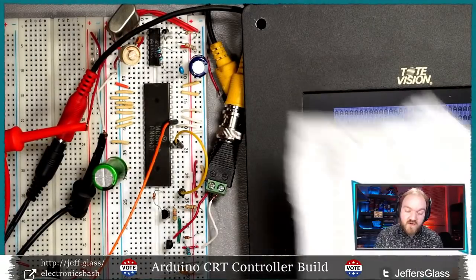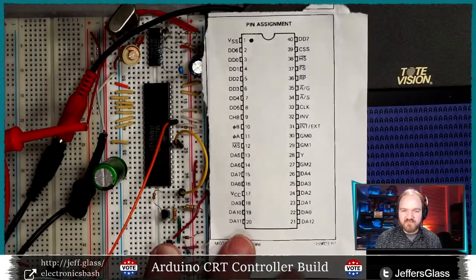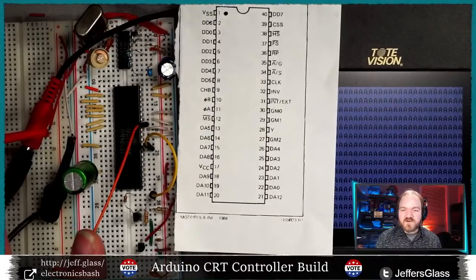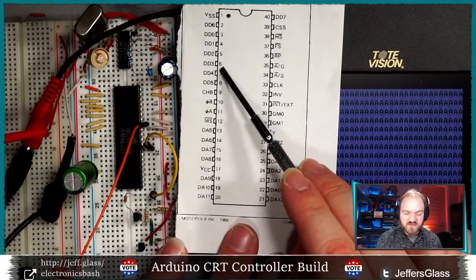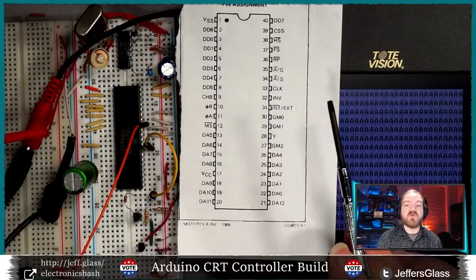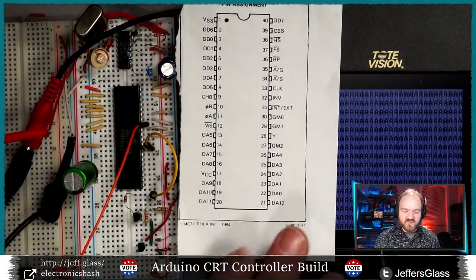So I promised to say, okay, so our mode settings here, there's a variety of graphics modes that this chip can operate in. The most basic, and the one that's in now, is alphanumeric mode. And in that mode, I think it's only the lower 6 bits, so D0, 1, 2, 3, 4, and 5, tell the chip to put out a single character onto the screen. And we'll clarify a little bit what we mean by put out when we talk about more graphics modes.